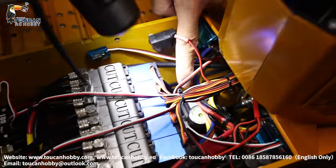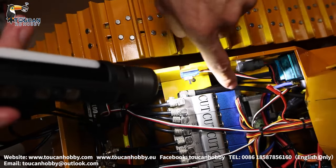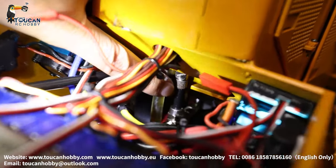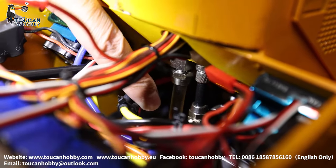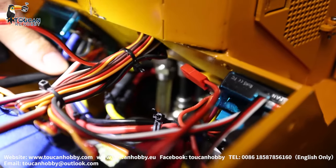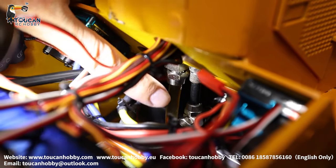This pump delivers oil via this hose to this side. On top of this hose, that's the return line to the oil tank. At this position, that's the suction line — suction goes to the two pumps. This transparent hose is the return line from the pump to the oil tank. From the pressure release valve inside the pump block, if pressure is too high, oil returns directly to the tank.